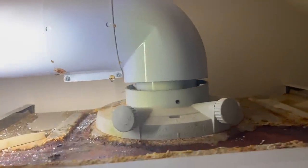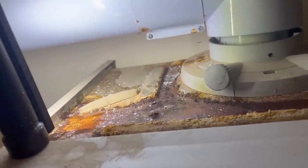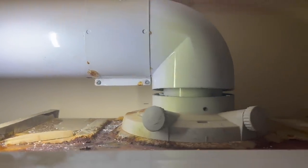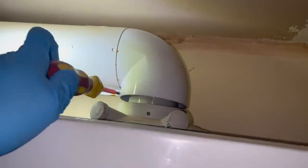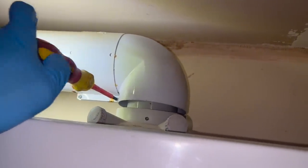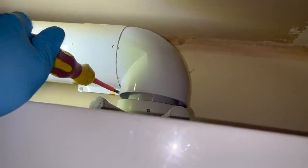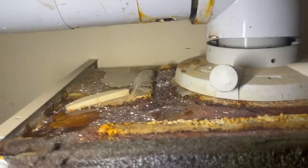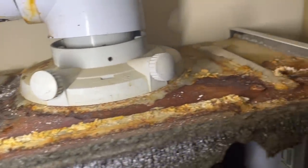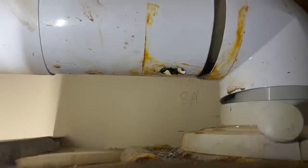For this job I was only supposed to be doing a gas safety check, but by inspecting the flue it's not looking too good. Firstly, it hasn't been clamped down properly at all. Secondly, I can see that it's leaking because I can see signs of corrosion. Let's take this band off and see what we're dealing with. We've got a nice hole in the flue there where I've moved the band, and you can see it's been leaking for a while because the top of the boiler is stained.